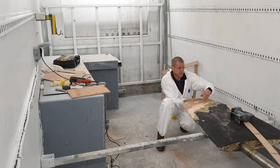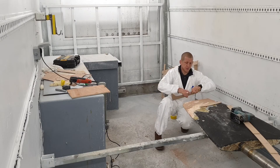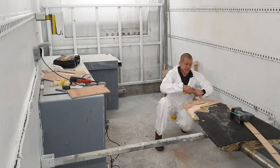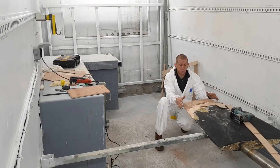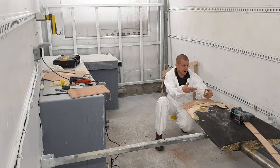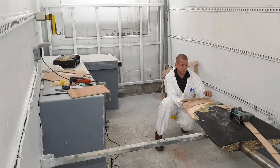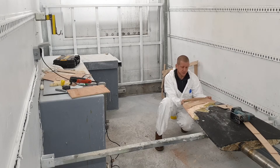That's quite a lot of filler to take up, so what you can do - anything really, any old scraps of wood - put that in amongst your filler just to take up some of the space, so you're not using two whole cans of filler on that. Otherwise you've got lots of scrap wood from your batten lying around. So once you've got that on and you know your depth you're trying to fill up, just chuck a load of lolly sticks and timber and bits in there, and just save a little bit of filler like that.